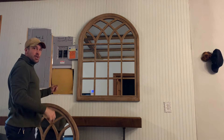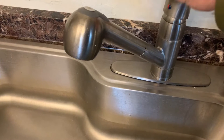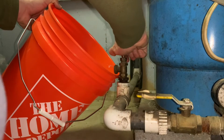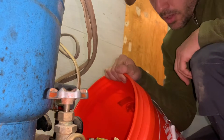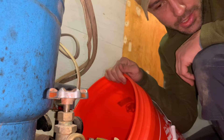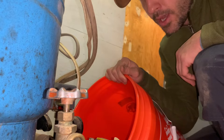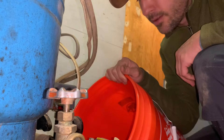The first thing we've got to do is shut off power to the actual pump that's submerged in the bottom of that 300-foot well out there. Some lines here drain the water at the lowest point in the house here, and I'll also drain it in the utility room. Just waiting on the last little bit of water to drain out of the lines here. But as I do this, I think taking steps like this towards your preparations are just essential because it will help maintain normalcy in a grid-down kind of situation.